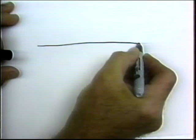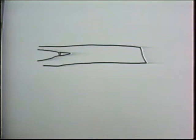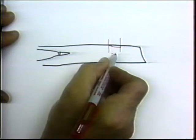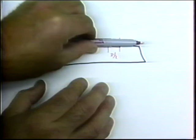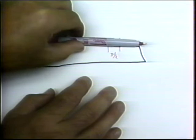Now, I just thought it would be worth taking a minute here to explain what I'm trying to accomplish, since we haven't done this on the video before. Here's the back of our fuse. Let's just say the fuse is going to end like this. We're going to wind up with something similar to that. Well, here's what happens. When you go to line up a tail, usually you make this little cut. And what you have is this dimension here is usually about 3.5 inches. So with this on center, it's real easy to get a 3.5 inch. If you're out by a 1/16 of an inch here in a span of 3.5 inches, you've got a tremendous problem. This tail is either going down, going up, or in some way you've lost the center line.